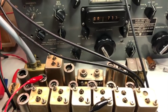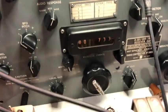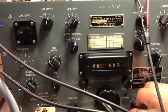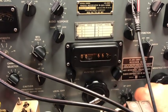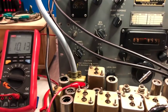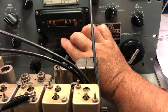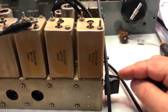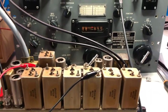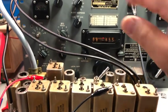I really believe that now the receiver is working as it's supposed to be. If I remove the signal and go to receiving on the broadcast band, I should have a strong signal here. Let's see if I can find it. At 0.1 bandwidth it's passing through the signal very sharply and I can hear it — so it seems fine to me.